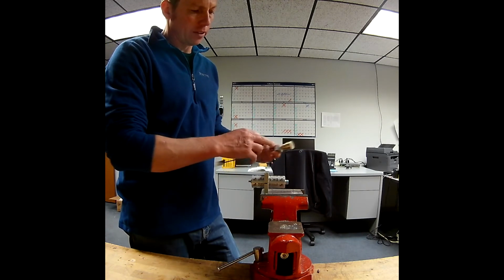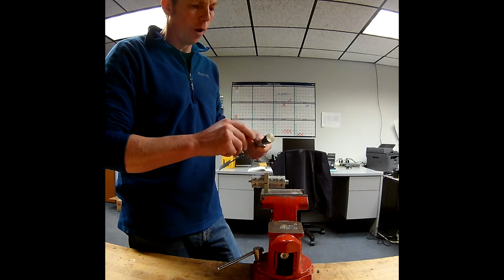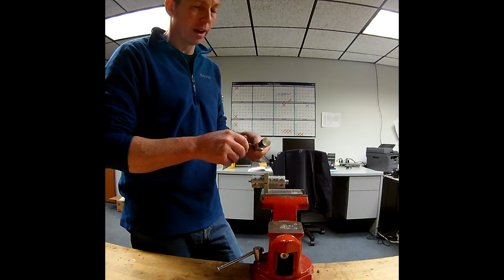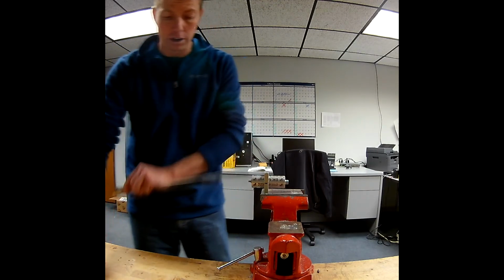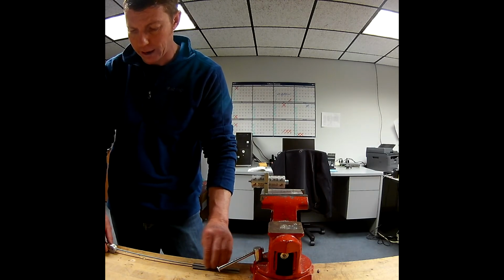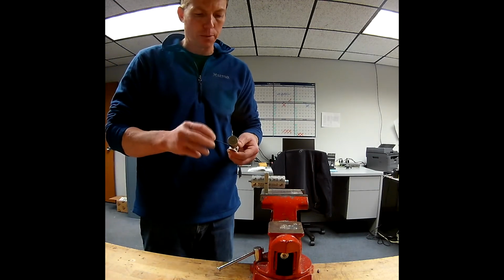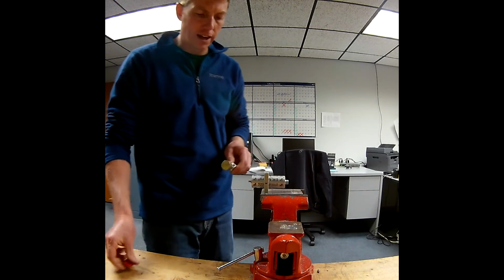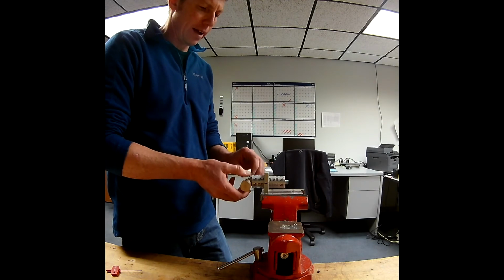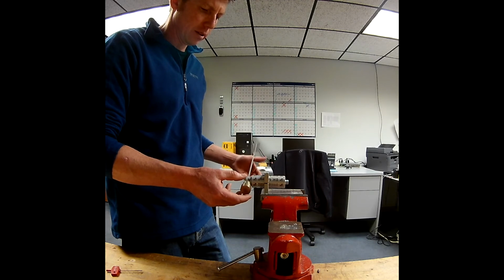So once you've got that done, there's a set screw here that you're going to then tighten down. That's going to tighten onto the wand itself and then onto that metal shaft that's inside so it doesn't crush it. Normally I'll put that on a workbench or a table, whatever I'm working on, so that I make sure that it's flat so it hits those tools perpendicular to the tip. Cinch that on down, put it back on, make sure that wand balance is pretty close.